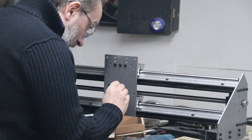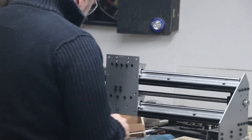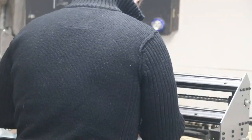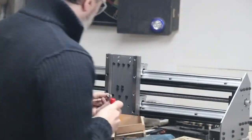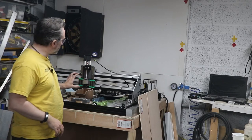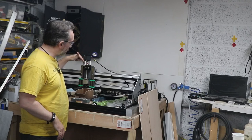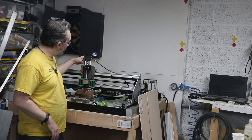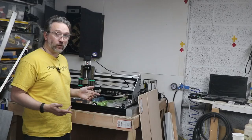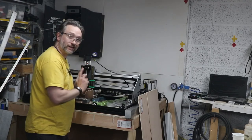I'm putting some low-profile bolts in the two edges where they're going to be next to the rails, so there's clearance for the actual bearing blocks as they come up and down. I attached the rails, then off camera attached the lead screw mount mechanism. I've been able to reuse the original OX CNC z-axis motor mount, just with a little L-bracket up the back. That space fits perfectly, so now I just need to take this hunk of aluminium and make the bracket that is going to fit there.